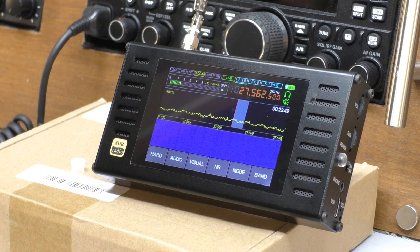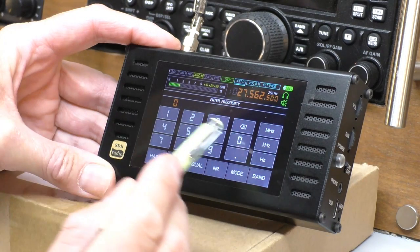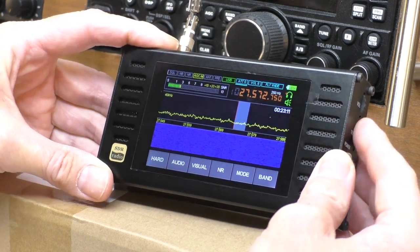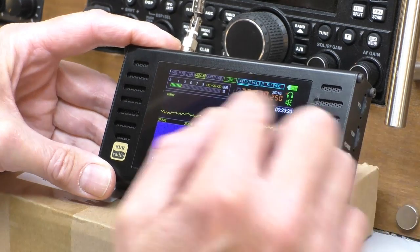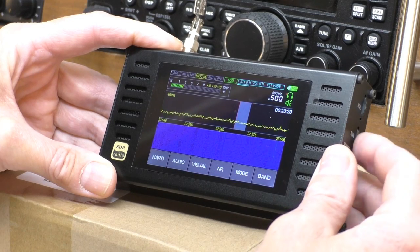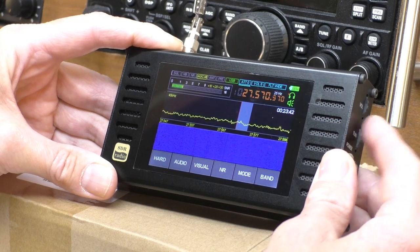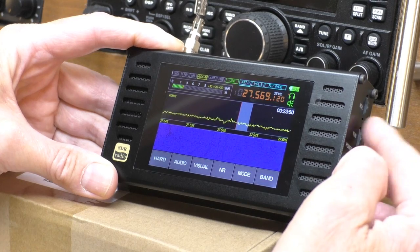When it comes to tuning the radio, you've got a couple of options. There's direct frequency input — quite useful if you know the frequency you want. You just tap on the frequency readout, a keyboard comes up, type in the frequency and away you go. For manual tuning there's the encoder on the side — it's a clicky encoder that clicks round and doesn't seem to miss any steps, which is good. I would have preferred a smooth linear VFO myself, but it's absolutely fine. If you want to change the step rate, just press it once and you can adjust it as high or low as you want — it will go down to 0.025kHz, which is almost like a BFO clarifier.